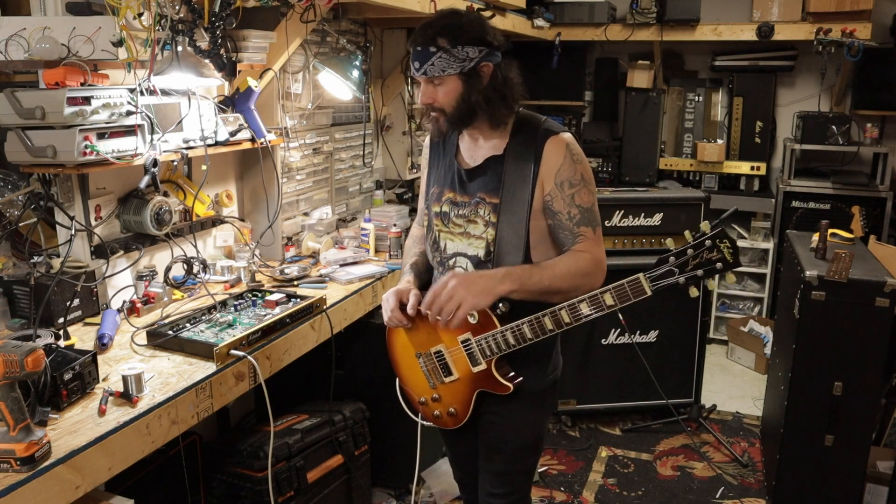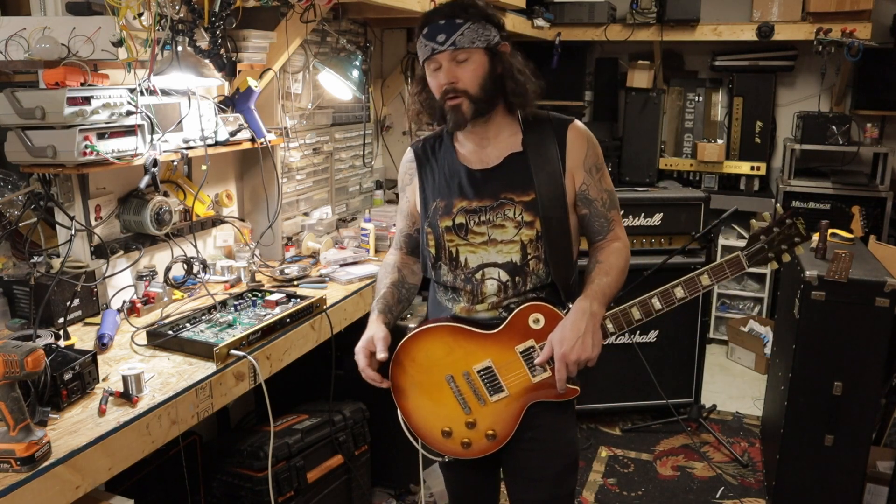Everything sounds great to me and that was a fairly painless process. I will include a schematic and a copy of the handbook for this amp in the description below. Hopefully this video will help you out if you ever have to work on one of these preamps. If you want to get creative, you can select between the two different primary voltages by using a switch - mounting it would be a little tricky, but it definitely can be done. In a future video I'll go through how to get this data knob from being so laggy and bouncy. Thank you very much for watching and hopefully I'll see you on the next one.